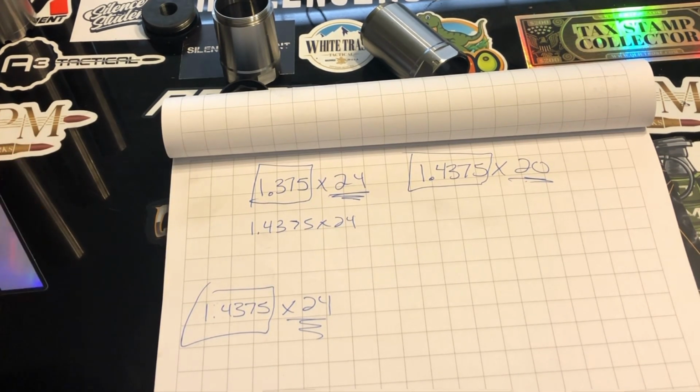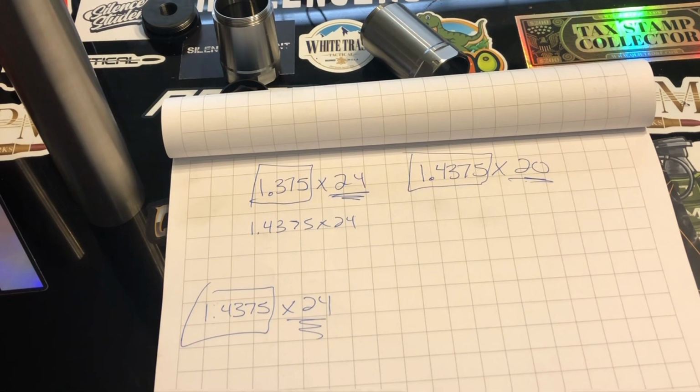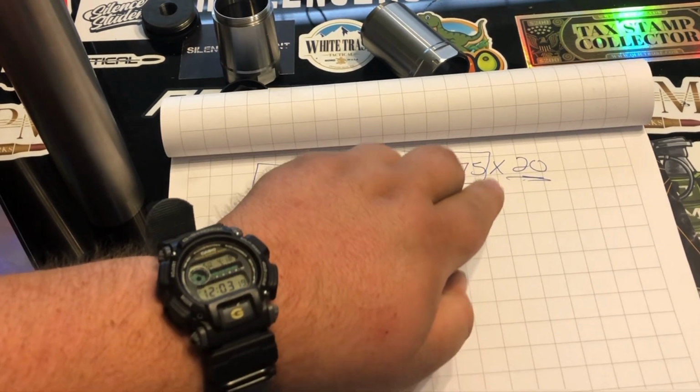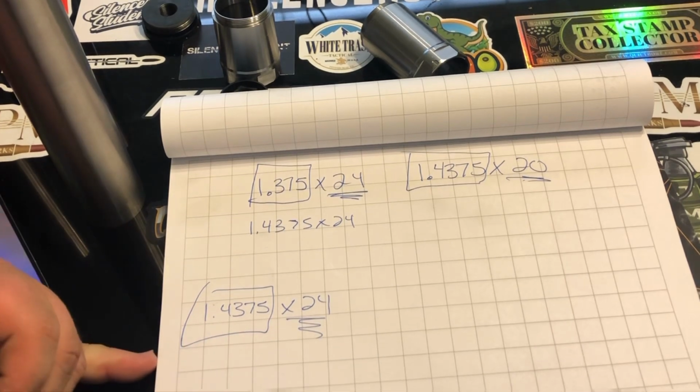And that gives a little bit stronger of a joint here. Back in the day, some people did have problems losing end caps and mounts and stuff. But you also have to remember that back when they were using this, it was mainly on aluminum tubes. And a lot of those aluminum tubes were of material that wasn't something you'd want to use building a suppressor. They'd be using 6061 or worse, usually tempered aluminum, not something like 7075 or 7068, I forget. Whatever. It doesn't really matter because we've now since moved into titanium and steels and stuff. But that being said, the size still floats around.